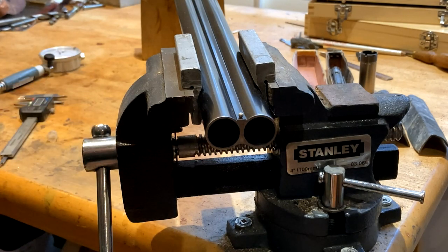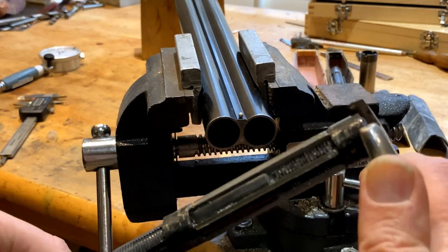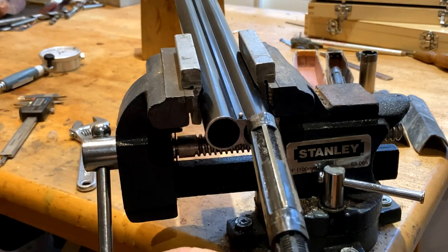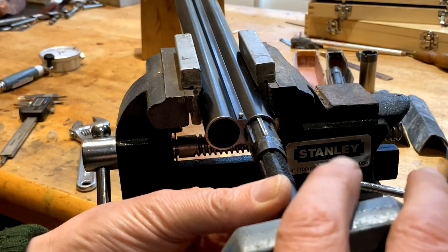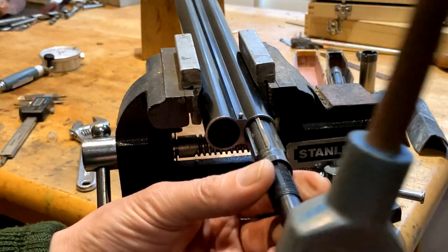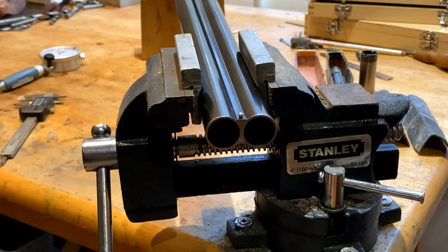Using adjustable reamers, obviously you can index infinitesimally small amounts in this manner. There you go. So that's the next index. Now that should just start to get a little bit tighter as we enter into the choke. Yeah, it's still not fully engaged yet. I always like to enter and begin the reaming process really quite gently.